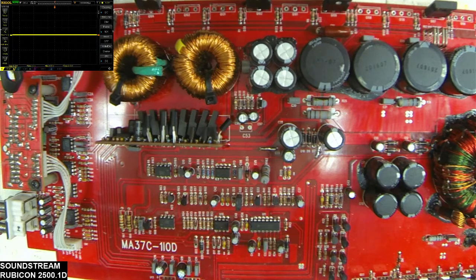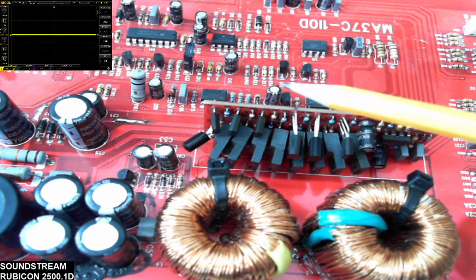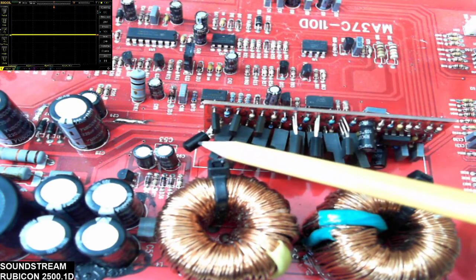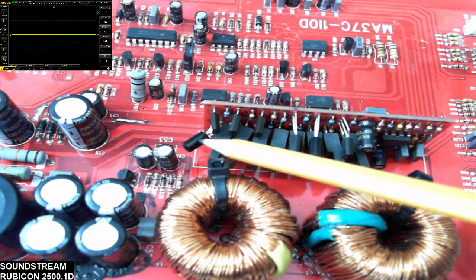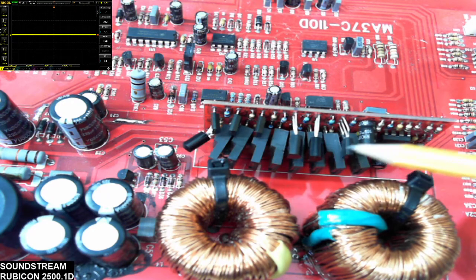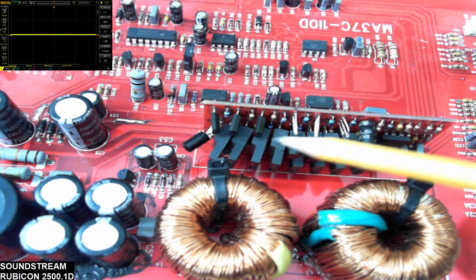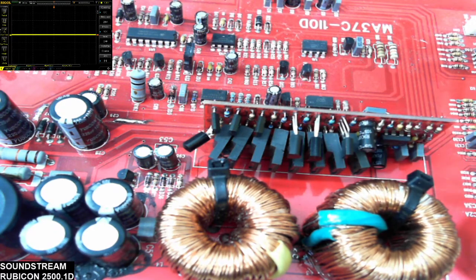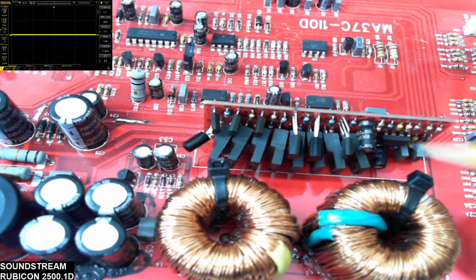This is how I have the transistors laid out to help dissipate the heat. As I noted in the previous video, this card runs extremely hot. So these transistors I kind of spread apart off the board to get some airflow going through them. Even though this board's going to be upside down and heat rises, you'll get some air going in between these transistors.